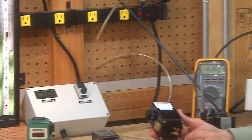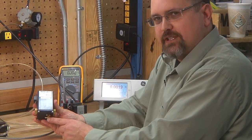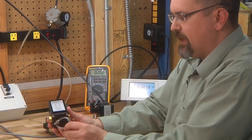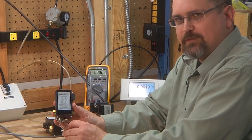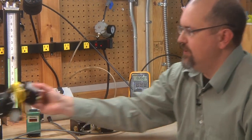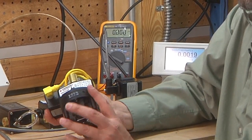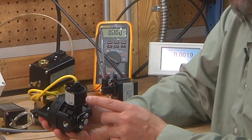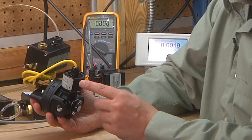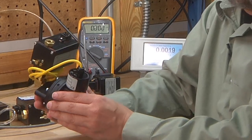That same resolution and accuracy can be had in a unit that is vacuum only. This is a 0 to 30 inch of vacuum unit. Also available is vacuum through positive pressure or absolute calibration, as in this model. Any of these models can be used to pilot operate a mechanical volume boosting regulator for much higher flow rates. A second transducer is used to measure the output pressure of the mechanical volume booster to overcome the mechanical hysteresis and stiction present inside the mechanical volume booster.